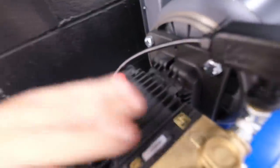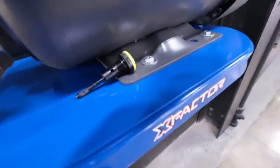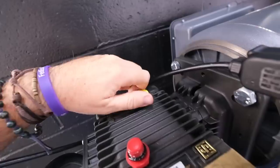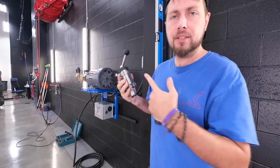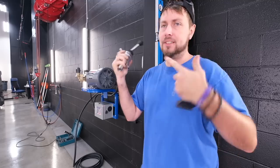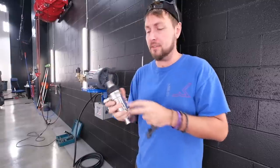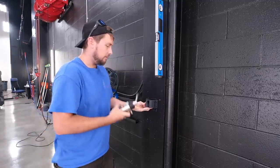I got my water hose in place — I brought it over from the reel straight down, nice and clean. I'm going to cut this and put a new barb on the end so it's the perfect length. These machines come with the oil in the pump, so they come with a cap that's sealed, but you want to switch it out for the included vented cap. This cap allows the crankcase to breathe a little bit, so make sure you put this on before you run it. I'm going to use my real deal valve so I can inject my two steps here, because the whole goal of this system is to see how fast I can do a wash. The ceiling boom is going to let me rip all the way around the vehicle in one pass, switch this lever to the second step, go over it with the second pass, and then rinse.